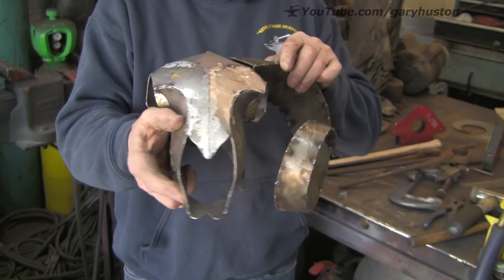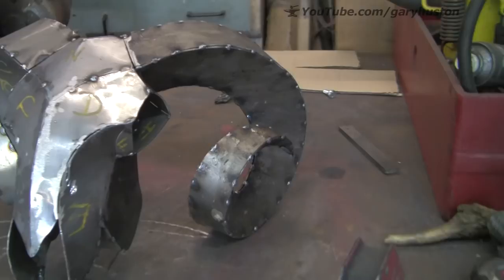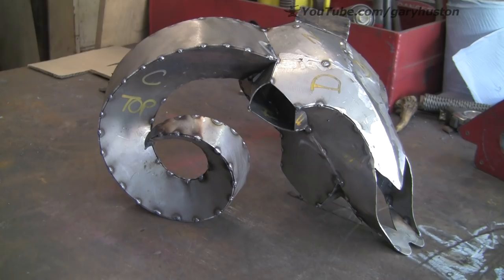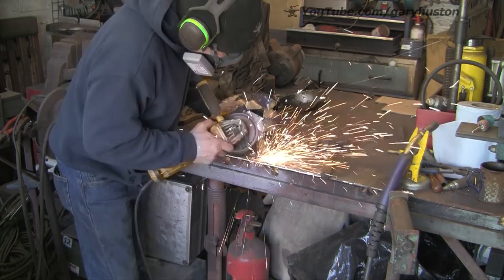There we go, just like that. So with the second one, because I did it slightly differently by alternating, it's coming out quite a slightly different shape. So you want to make sure you do both of them the same. You see the left one is a slightly different curl to the right one, and that's purely because of the way I tacked them up. It doesn't show too much — you probably wouldn't have noticed if I hadn't told you — but there is a difference. So I would recommend that you alternate between all three parts — the two sides and the underneath — when you're putting it together.